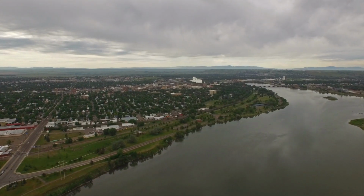As soon as we're done with this water pop, this application of the water on the floor, we're going to go to dinner and we're going to spend an hour, hour and a half, and let this completely dry before we start the stain.